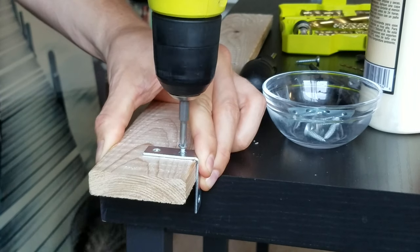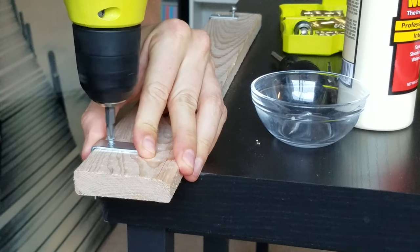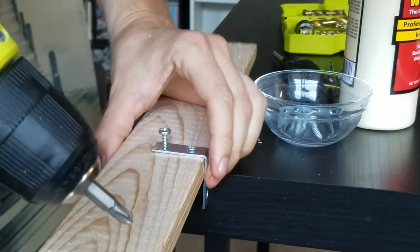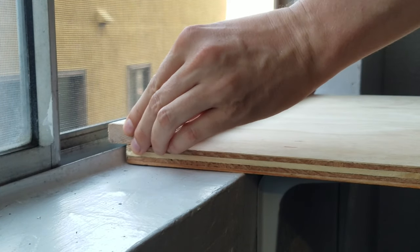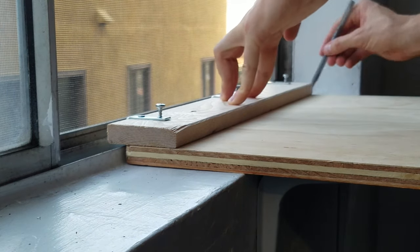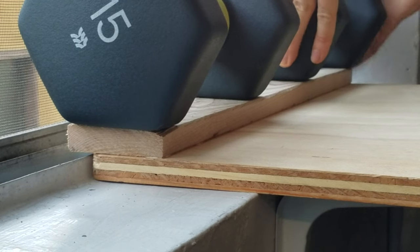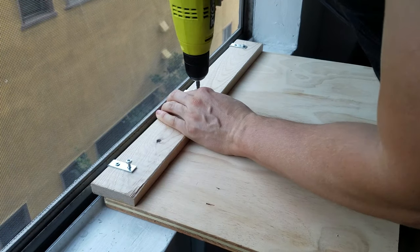The screws I'm putting in closer to the edge are half-inch screws and I'll use three of those, one on each brace. The screws I'm putting closer to the middle of the plank are one-inch screws — they'll need to go not only through this piece of wood but also into the platform itself to hold it together, so I'm only going to screw these halfway in for now. I'll put all the pieces together, make it hold tight to the windowsill, and then mark off where it needs to be attached. I'm using wood glue to hold the pieces together and then I'll reinforce with the one-inch screws. After the glue dries I can finish screwing in the final three screws, and I think this will provide ample reinforcement.